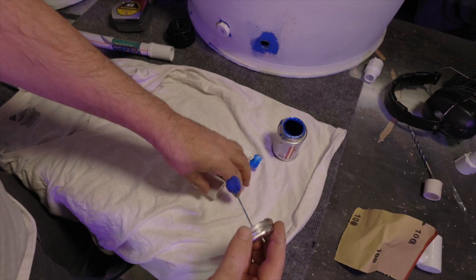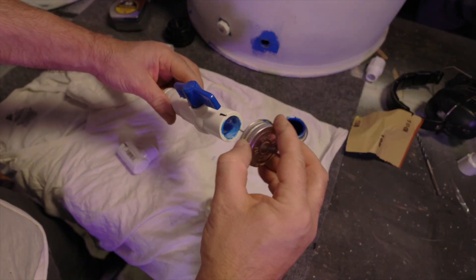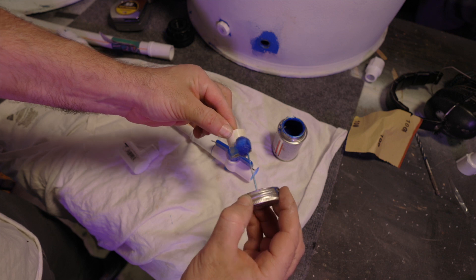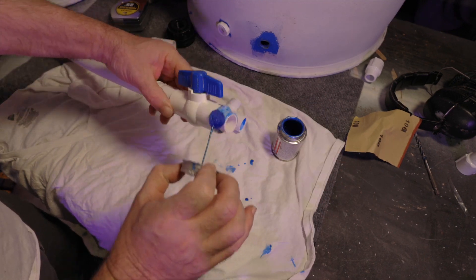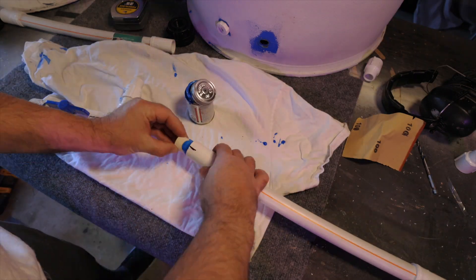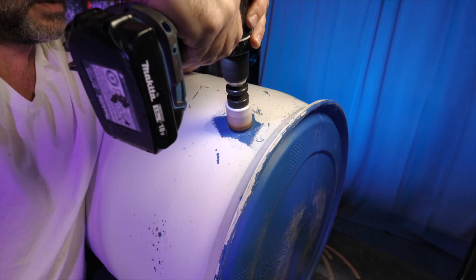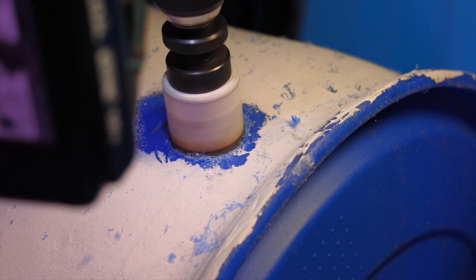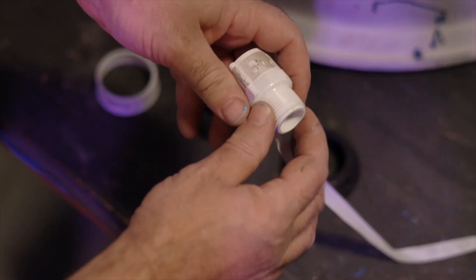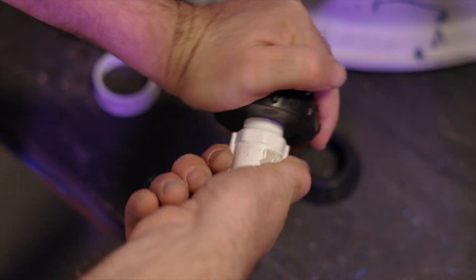Christie's Blue Glue — you glue everything together. Make sure you put glue on the inside and outside of the piece. I learned this the hard way after putting some pipes together and they leaked, and then I couldn't get them apart. Grab some Teflon tape and wrap it around there a few times.